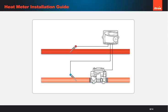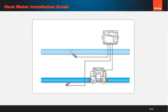The temperature sensors should be connected to the correct pipework. For heating applications, the hot sensor should be inserted into the supply line and the cold into the return, with the head pointing up. For cooling applications, the opposite applies — red return, cold supply, and pointing down.